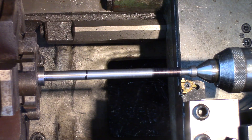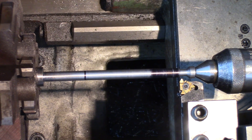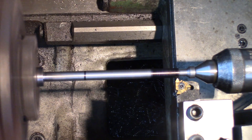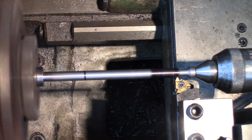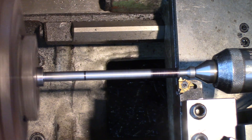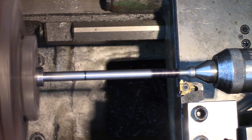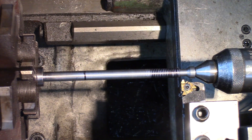I'm going to do a test to see if we have the right pitch. Let's start and see where we end up. Make it zero. Reference. Touching. Now we'll make just a test pass to see if we're going in the right place. Let's check this out — 18 threads per inch. Looks great. First cut.